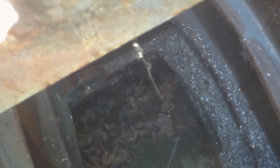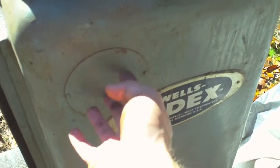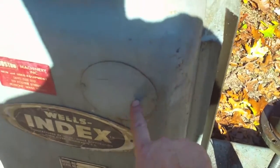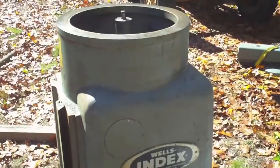What I'm thinking is I've got a couple of options. I noticed these little metal plates right here that are riveted on — they're just little sheet metal plates — and they would expose a large hole right there in the casting that is actually beefed up. There's one on this side and one on this side, exactly opposite each other, and there are actually two in the bottom also. So I'm thinking if I get these caps off, I could put a chain right through these two holes, pull my strap right through those two holes, and lift it that way. The more I look at it, the more I like that idea over everything else.